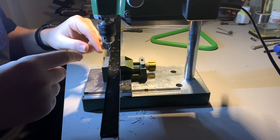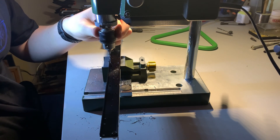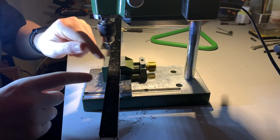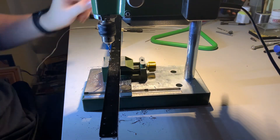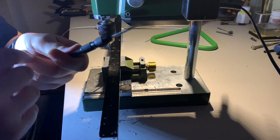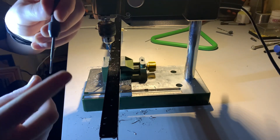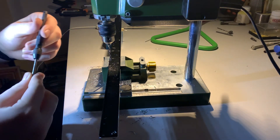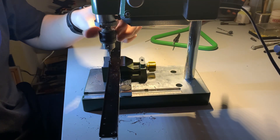For the 2.5mm holes: I'll hold it in place, move it down, and while it's down I'll spin it a bit. If you listen carefully you'll be able to hear if the drill bit's catching on the thread that's already in the pre-built chassis rails — if it is, just line it up slightly. If you catch it just a bit, because there is some paint on there, all you do once you've drilled your hole is go through with the tap. Just run it back through and it'll bite on the thread that's already on the black rail and transfer it onto the aluminium rail below.